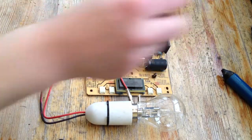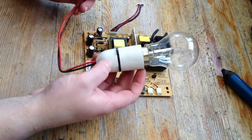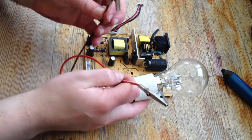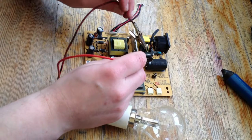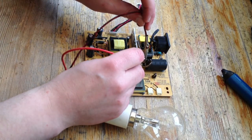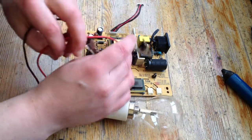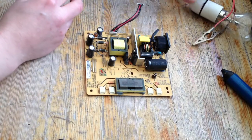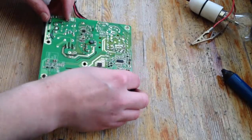With the board on the table, the first thing we want to do is discharge the capacitor. This power supply has been off for a good while, so I know there's no charge in it. But what you can do is hook up a light bulb — just connect two wires from the bulb across the electrolytic capacitor to discharge any charge that might remain. Once you've done that, you're free to work on the power supply without fear of getting shocked.